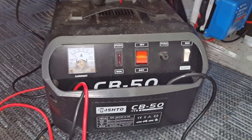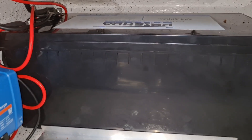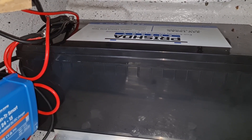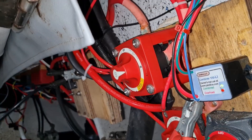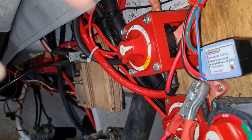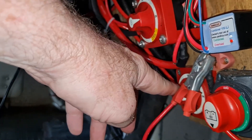Now that the job's finished, I've got the charger on charging the batteries. You can see the Victron unit there is taking 12 volts in and putting 24 volts out to charge the battery. I'll show you the charge state shortly. That's the battery there — I can't get over how light these lithium batteries are. That is way lighter than even a single 12 volt AGM. I had two 12 volt 140 amp-hour AGMs in there for the trolling motor, and that one lithium is lighter than one of them. The little Yandina charger there — you can see the green light on it — she's going fine charging up the other lithium battery, the 12 volt one. I've got the home battery charger connected to the 12 volt positive and negative, and over there is my trolling motor isolator from the engine alternator to the Victron unit.